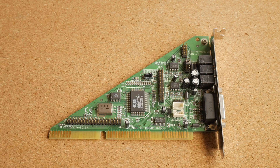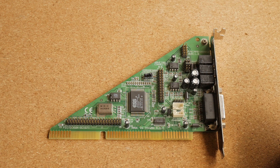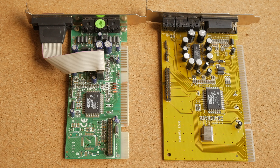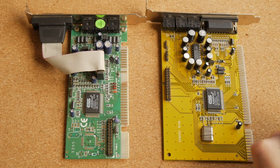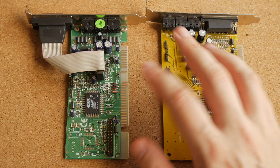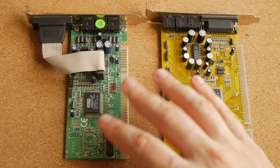Another excellent ISA sound card is this card made by Formosa. It is based on the ESS ES1868 chip, which is fully compatible with Adlib, SoundBlaster, and SoundBlaster Pro. It also supports its own implementation of FM synthesizer called ESFM, which sounds almost indistinguishable from the real OPL3. The main problem with ESS-based sound cards is that they were made by many different companies, and their quality ranges from excellent to terrible. Here I have two more ESS-based sound cards. One is also based on the ES1868 and is absolutely terrible — it has a very noisy output, and its wavetable header is not properly implemented, so it simply does not work. The card next to it is based on the ES1869 chip; at least its wavetable connector works properly, but its audio output is also very noisy. I cannot recommend these two sound cards. In fact, I don't even know who made them, because they have no model number or manufacturer's name printed on them.